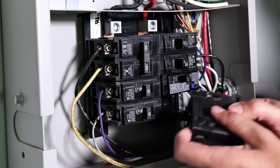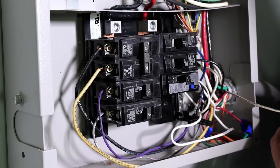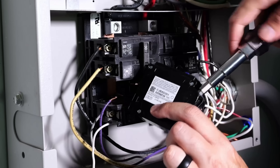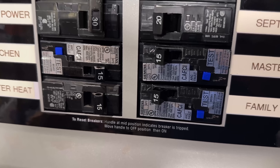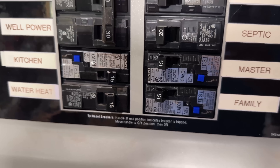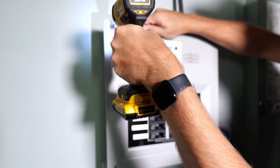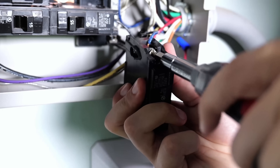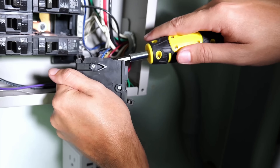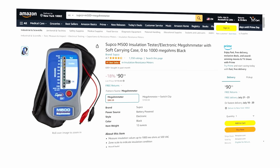Make sure you're using the proper brand for the panel you have, and also make sure you're using the proper type. Go out to your panel and make sure you've got the proper breakers installed — not only would incorrect breakers be against code, but you could also be running a risk of potentially very dangerous situations. For convenience, links for different brands of AFCIs, standard breakers, and all the tools used in this video are in the description below.